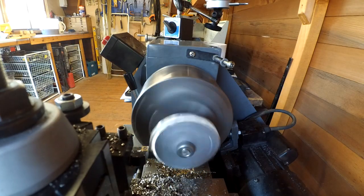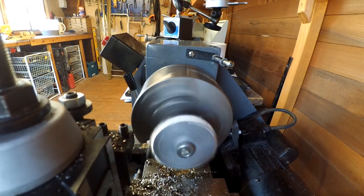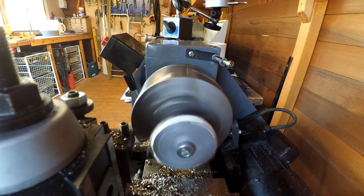It's about a 6mm plate. Then I used a couple of 10mm nuts to attach it to a length of 10mm bar to make a makeshift mandrel which I could then put in the lathe chuck for machining.